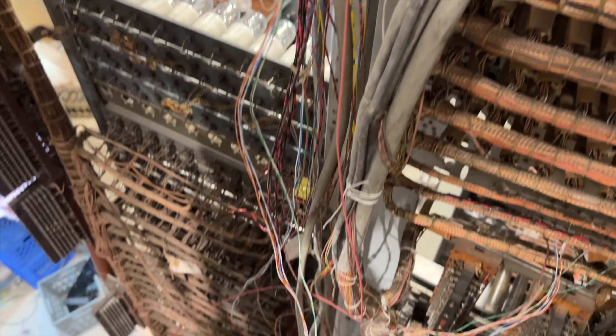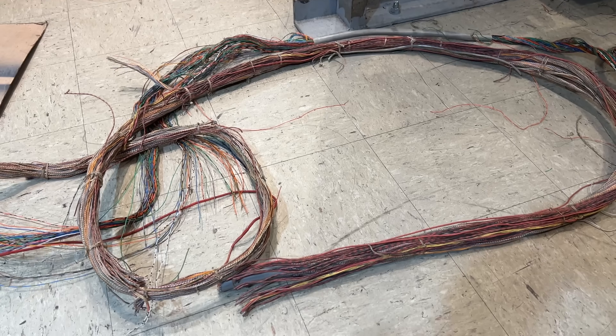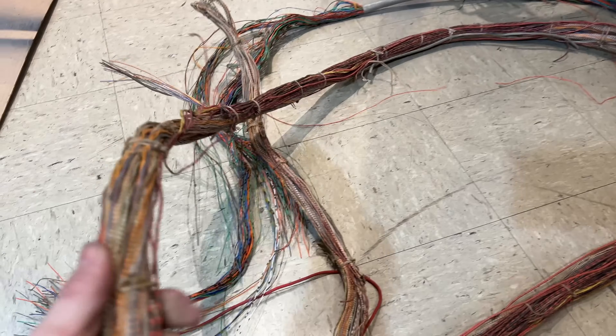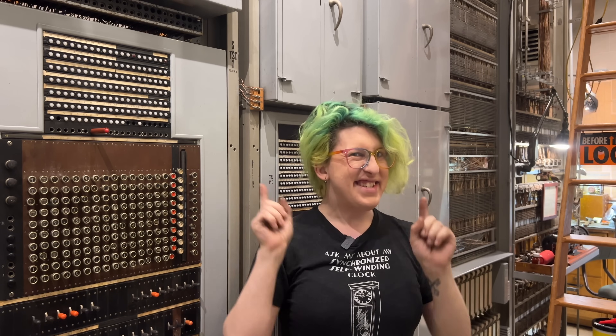Others should be unlaced and rerun correctly, which is much easier to do now that the frame is temporarily cut dead. The nice thing is that now that the dial and station ringer test circuits are right next to each other, I can reuse their original wiring to interconnect them. I couldn't do this before because they were far enough apart that the wire pigtails hanging off wouldn't reach from one to the other.